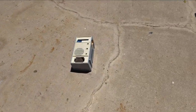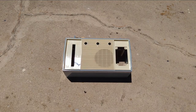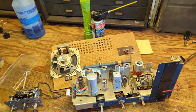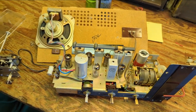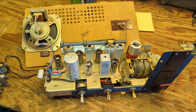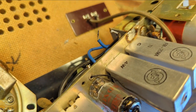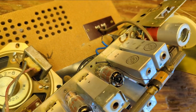So I cleaned up the cabinet, looking pretty good. I need to let it dry here for a while. While I'm waiting, I'm going to do the last part of the electrical restoration, which is to add the audio input feature. This is going to be a lot easier on this one because it already has a phono jack — so I'm just going to run in through the audio. But as this is a hot chassis set, I'll need to add an isolation transformer between the audio input and the phono input. That blue and black lead is the original phono input connection, so I'm just going to run it directly through those leads.